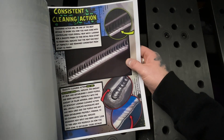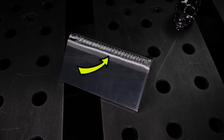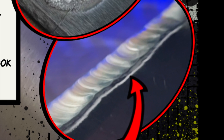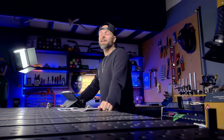We are going to look at the cleaning action. This is the white, snowy-looking area right next to the welding pass — it's the oxide that's been pushed aside by the cleaning side of the AC balance. As we travel from start to finish we want this area looking very consistent: no spots where it's bigger than others, no thinning out as things get hot, and the quality of it nice and smooth. If you see the cleaning action diminishing, it means you are running with excessive heat input.